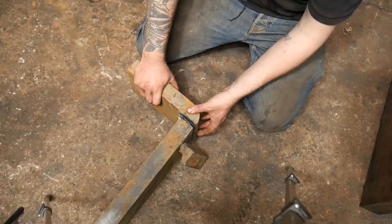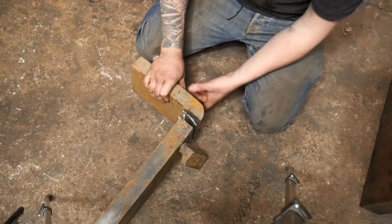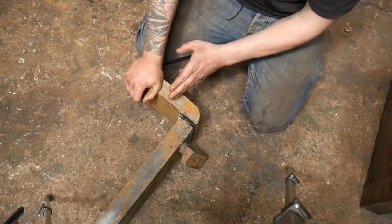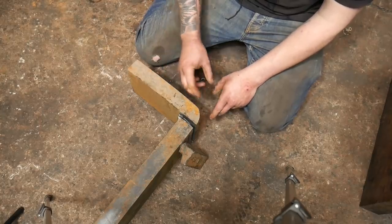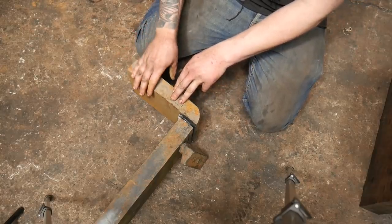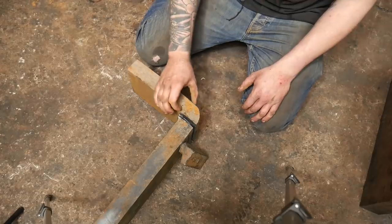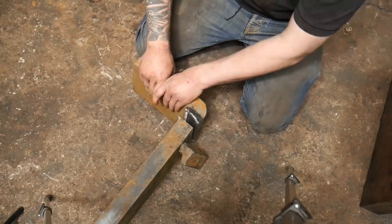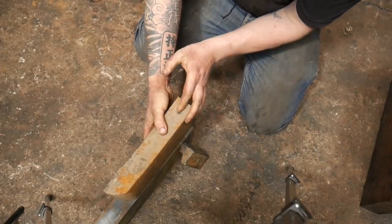On the heel, this normally gets wasted. I normally cut across here and across here on the heel, but I've started cutting straight across the bottom of the heel in one of the planes and then chopping a piece off and drawing that out under the hammer. This piece will have been worn away on the back of the heel, so this material tends to be a funny size and shape — it's not great for drawing out into material, but it's good for odds and sods. You'll find that this section here is thinner here than it is here, so it's not quite the same anymore and you can see it's lost a bit of material.